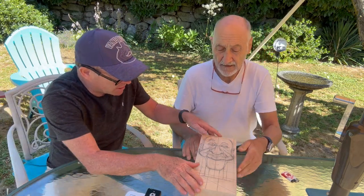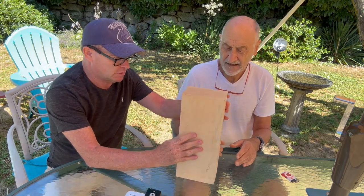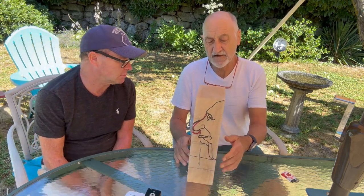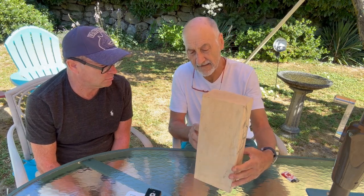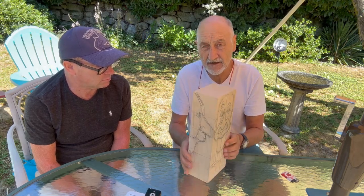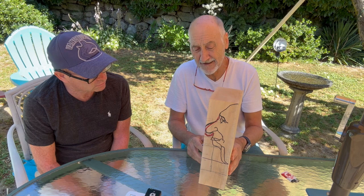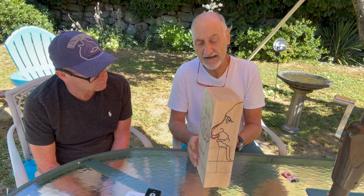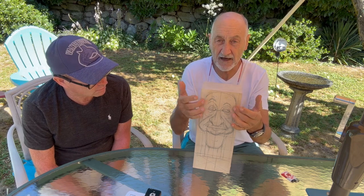Can I ask you a question about this? Now I noticed on the block of wood you've got this side profile, on both sides, right? Yeah, but this is more experimental, trying to establish the correct face form. You see, this is not quite right. The side doesn't quite match up with the front, but that's okay. I'm not so clever that I can translate that easily. I have to get an outline, guidelines, and then I start essentially working by cutting the profile. So I use a bandsaw to cut the profile.